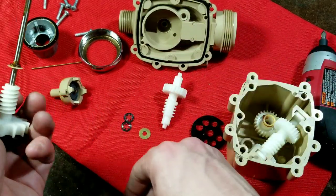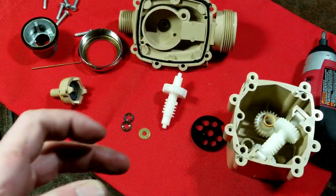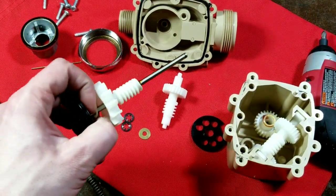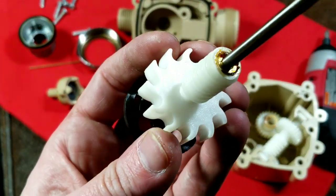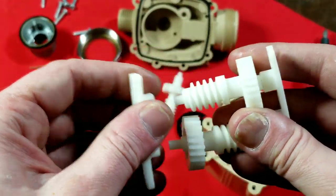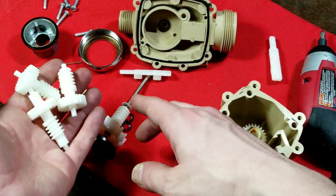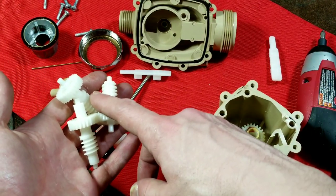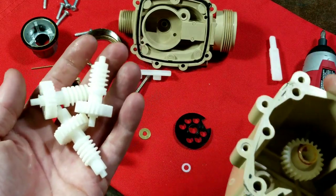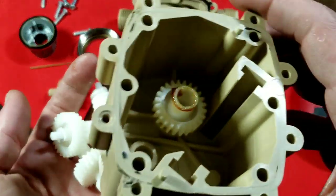Here's the internal rod, so we get to see all the little parts associated with this unit. There's a little washer and a spring for the pre-tension. Here's the nylon turbine, and then here's the remainder of the gears. These two are interestingly held on a little carriage, but they're more of the same as this first one. So you actually had all these levels of reduction - let's count them: one between the first two gears, two between the second and third gear, three between the third and fourth gear, and a fourth reduction. It's a quadruple reduction.